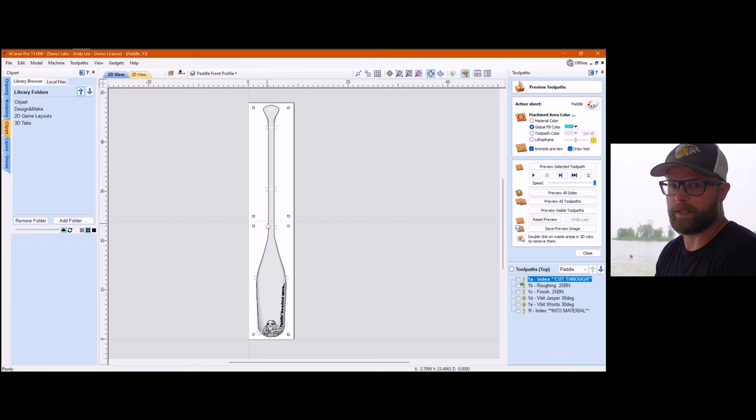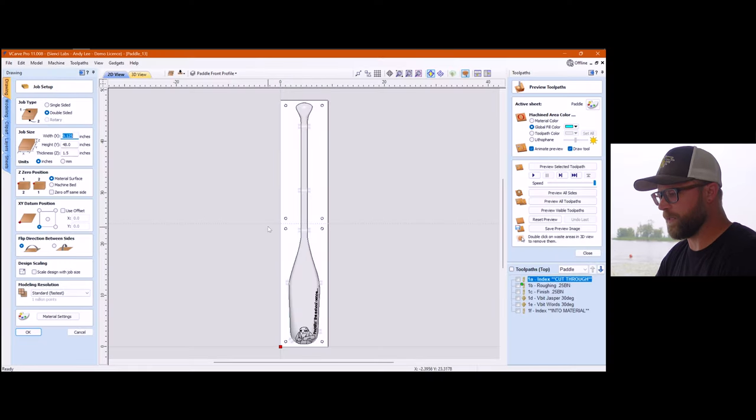Ultimately, you don't have to do the index holes where they're recyclable, but I kind of wanted to because it was dimensionally easy enough to do and it saved drilling extra holes in my wasteboard. So we have a 48 inch file document size. Half of 48 is 24, so we put a little guide in there.